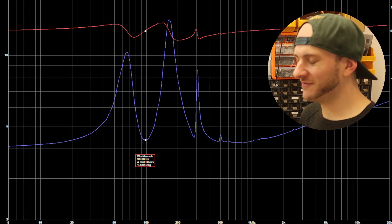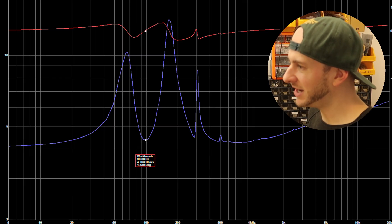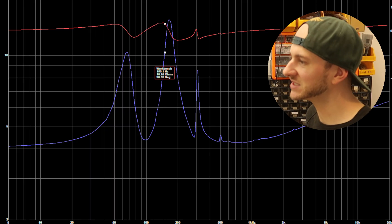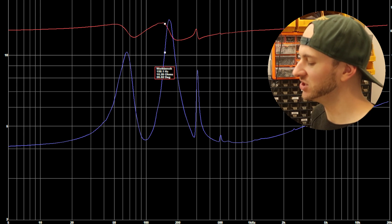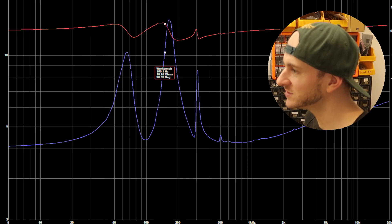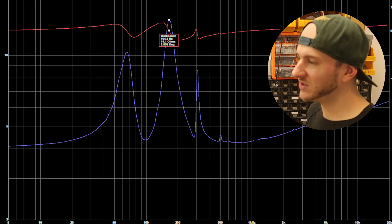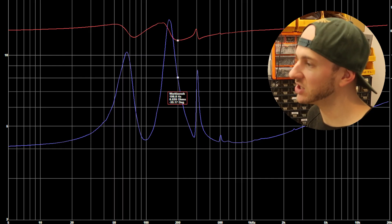This could be a bit of a low-frequency monster. I might have to get some different test tracks just to see what this can do down at those lower frequencies. The first frequency we test is 25 scaled Hz which is 150 Hz, and that is all the way up here about three quarters of the way to the second impedance spike. We are at 10 ohms at our first test frequency. I think we're going to get mechanical limits reached before 15 watts for sure, unless there's a lot of cabin loading. The impedance spike itself tops out at about 164 Hz at 14 ohms.